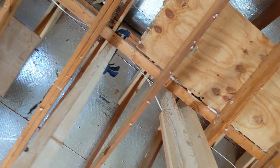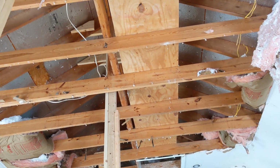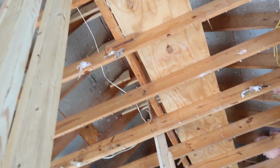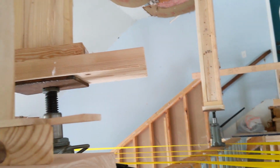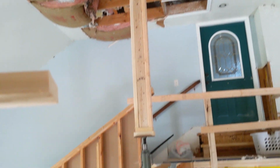I've also got them clamped to either the collar ties or a supporting member up there that also helps them at that point not to bow or twist out. Everything is nailed to a collar tie or something else that also has to go up, so that if a jack suddenly shoots out or whatever, the jack might fall, the blocks on top of it might fall, but the post itself will not fall. You do not want a post coming down on your head.